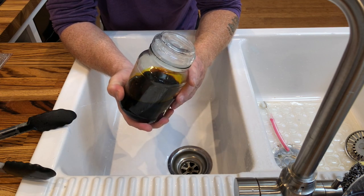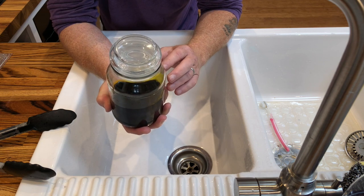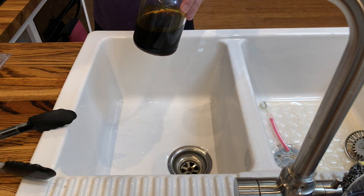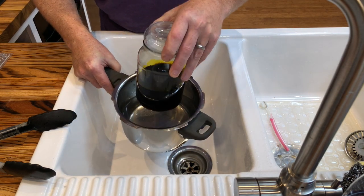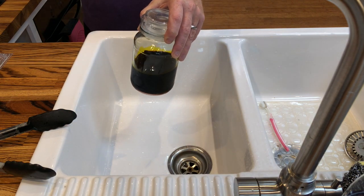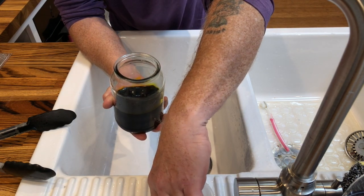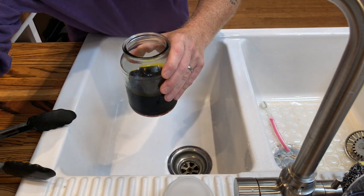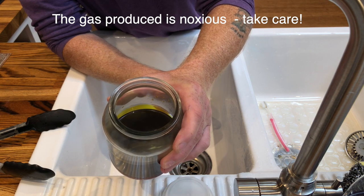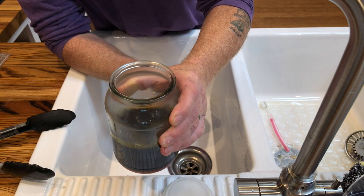If you have it cold, the acid etching process takes a long time, so I heat it up in the microwave — not very carefully, and I'm not necessarily suggesting you do this. The alternative is to sit the container in a pan of water and heat that on the stove. For me I just want to get on with it — 50 seconds in a 900 watt microwave, no more. You can see a little bit of steam coming off — you don't want any more than that in the house because it stinks. I always do this process under the extractor.